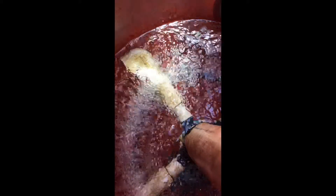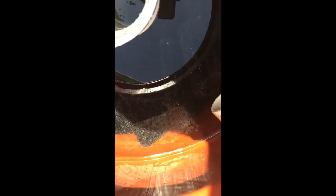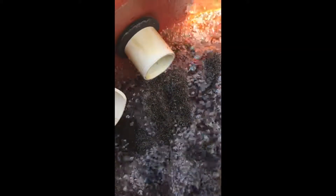I'm going to go ahead and put all the coarse pads in, put the filter screen back in as you see in the previous videos, and then we'll see what it does from there. I've got most of the coarse pads back in now, loosely packed — not standing on top of each other but loosely packed in. I'm going to go ahead and turn on the aerator and see how it works coming up through the coarse pads. You can see how much action I'm getting coming up between the coarse pads, and again, this is only three pounds of air.